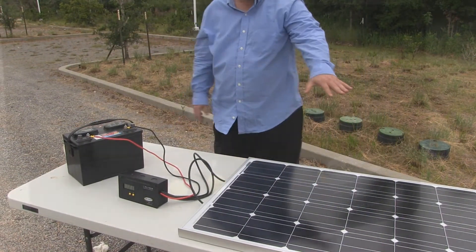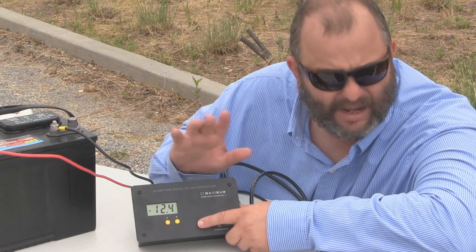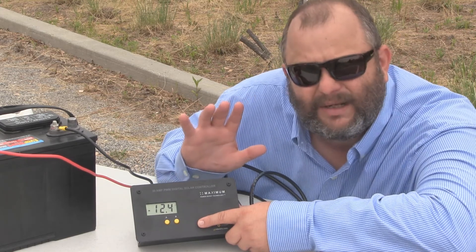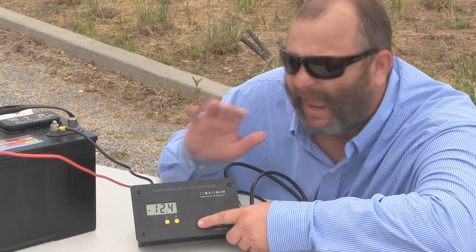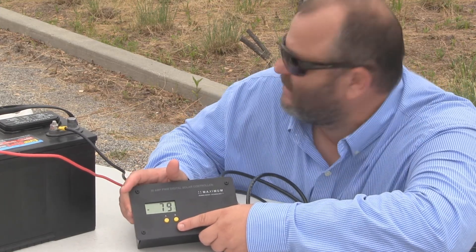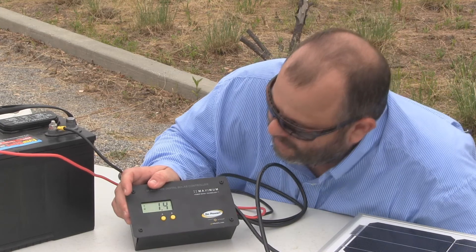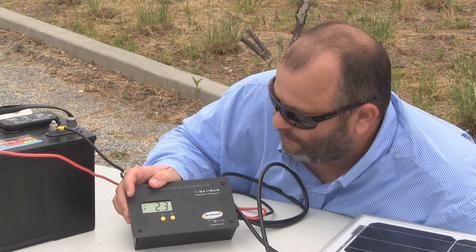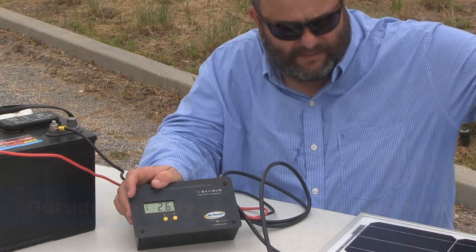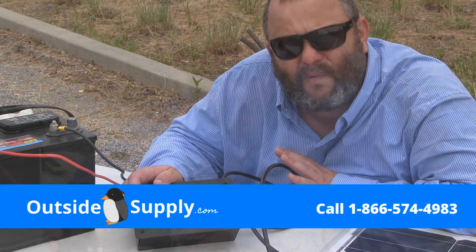I've flipped over the panel and it's now catching the rays of the sun. We've got our solar panel set up and charging to the battery. It's a very overcast day here in Waveland, Mississippi at Outside Supply, so we're not going to get a tremendous amount of amperage from this panel, but we're still going to get some — even on the worst days you still get some charging. If we push the B button, you'll see that our battery is 79% charged. Push it one more time and we're actually getting zero amps out of the panel — now it's 1.4, 2.3, 2.6 — depending on how clouds are moving over the panel it will vary. This panel will max out at about 9.1 amps.